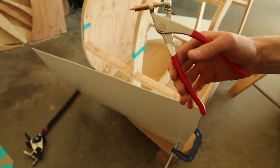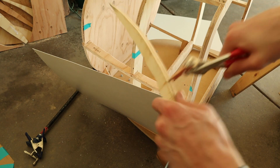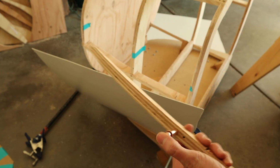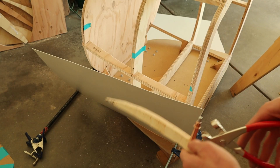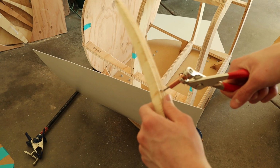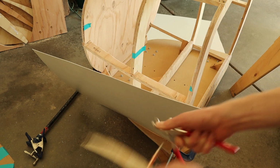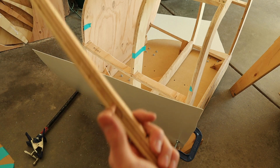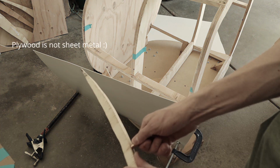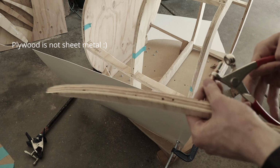Clecos look like this. They're very fun, and you stick them into a hole that's drilled the correct size, and they stick. They're used for sheet metal, especially in the aviation industry, but I'm going to use them for sheet, whatever the heck fiberglassy thing this is, and wood. They actually stick pretty well, and you'll be surprised they don't want to come out. Just like people after the coronavirus. Once you press the button, it comes out super easily. And you'll notice it doesn't want to... Oh, oops. Okay. Shh. Pretty neat, huh?